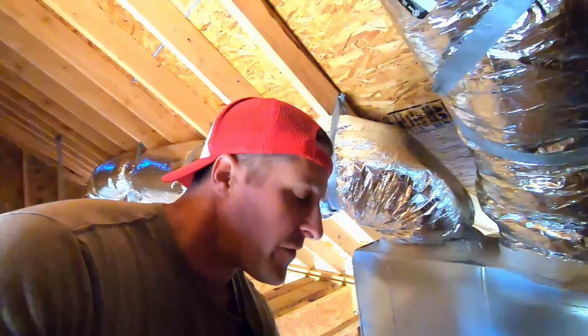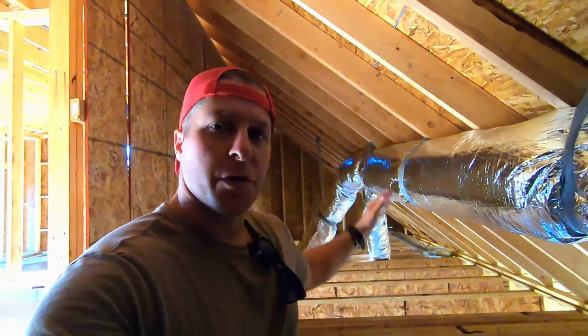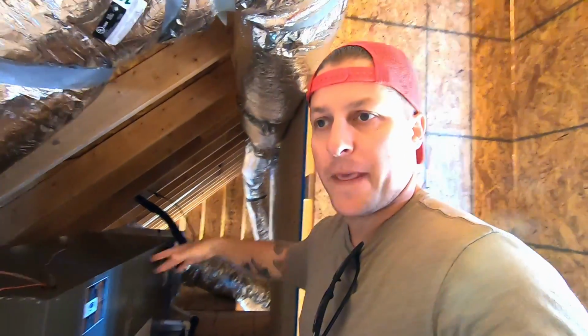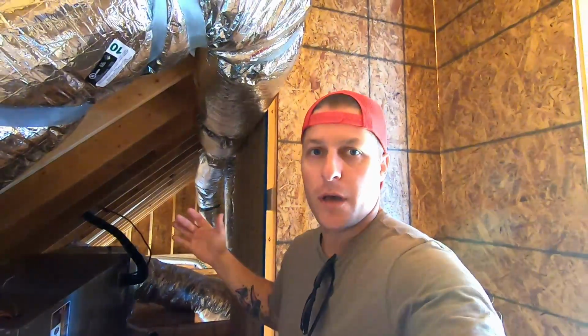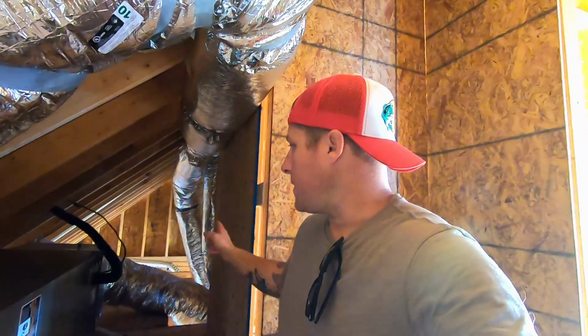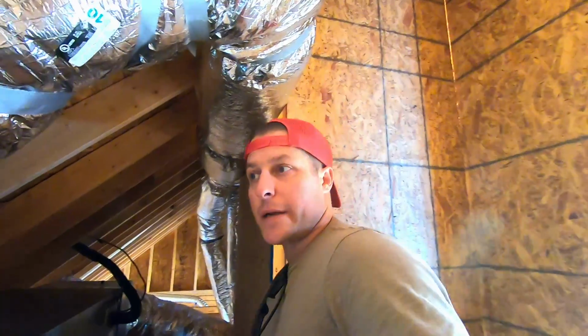So on your feed and return, your feed is what pushes all the cold air out after it goes through the system and cools down and filters, and your return is what pulls all the air back in. And they're supposed to put those feeds and returns kind of far apart, so that way it actually circulates the air in that room, and then it'll actually draw it back through a filter also. That's where you change your filter, usually after the air gets returned. It filters and then goes through the system, cools back down, and then goes back out through the trunks through the house.